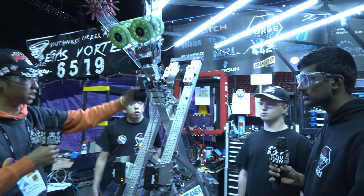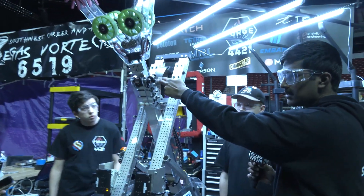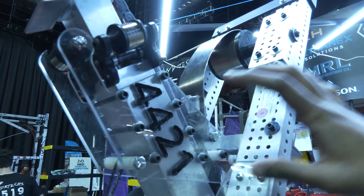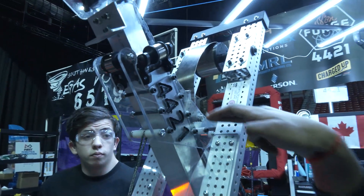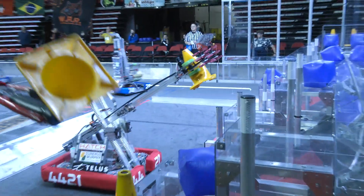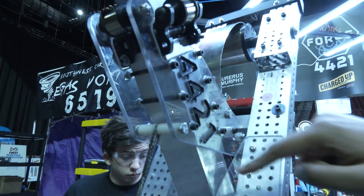Can you tell me about the tensioner? That's a 47-pound spring, and we're pulling it down with two NEOs both at 15-to-1 on a winch. They're both connected to what we call the forearm plates. They attach to the bottom section of the forearm plates, and the spring attaches to the top, so the spring pulls it up while the motors pull it down. This also holds the end of a cable holder and a third spring for the thrifty telescoping tube. It attaches to the two-inch tube via compression of these bolts, and we've engraved 4421 in it.